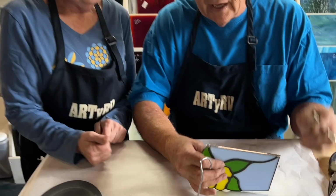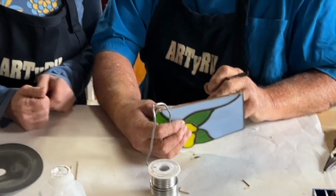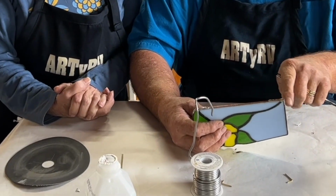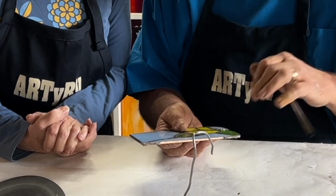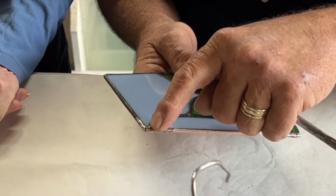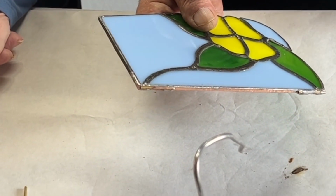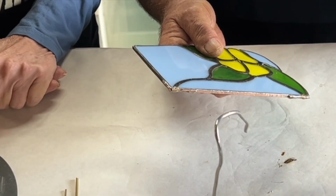And that's great. Now what we want to do is bead this back edge up, because we really need this foil to be quite rigid, even though it's just hanging on the back. The other thing we want to do is bring this line here down on top of that hinge. That's going to give us our point that separates the back from the front, which allows the hinge to rotate on the box.